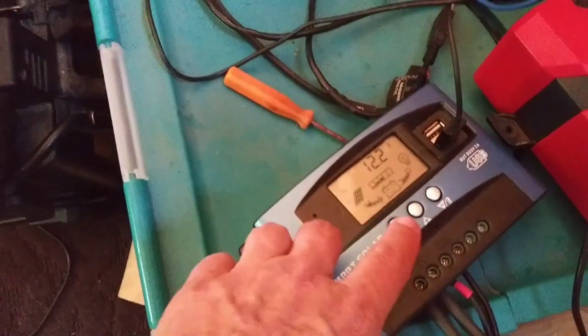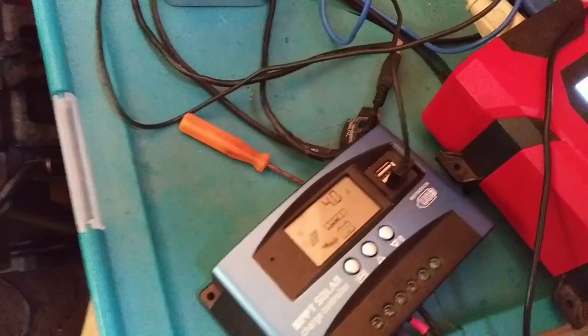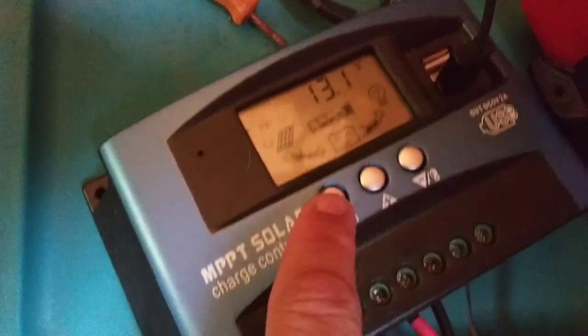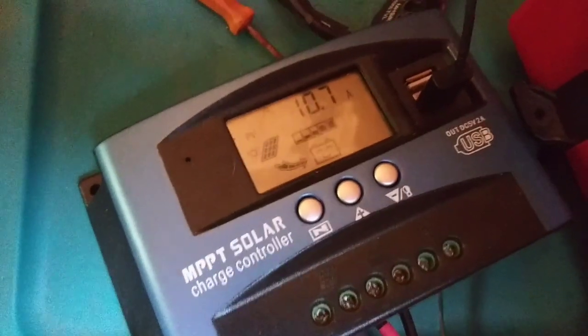It fits nicely there and I think it'll work fine just where it's at. I'm going to watch my solar throughout the day and see how this holds up. Look at that — we're already at 4 amps, and it's only been about five minutes since I checked. The sun is fully on those solar panels now. We're up to 13.1 volts and it's only been about an hour — that is great and it's only going to go up from here.